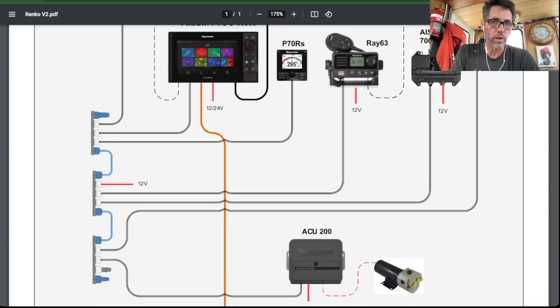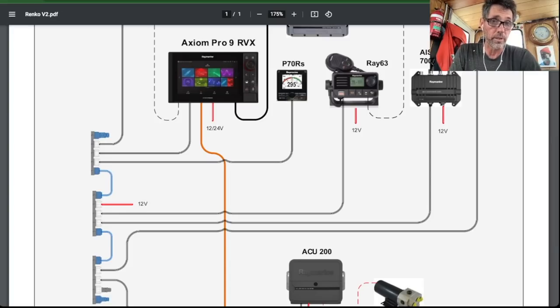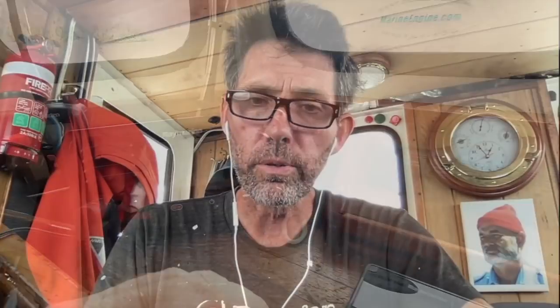You can control the EV1 with multiple dedicated displays in different parts of the boat. The best home analogy is networked printers: you used to plug a printer straight into one computer, then they became network-shared, and eventually the printer connected directly to the network so anyone could print to it. That's the setup we're going for on the boat. Another great example: the VHF radio can send a DSC distress signal with GPS coordinates. Because it's on the network and there are four GPS sources, if anything fails it can fall back to a different GPS source — giving you redundancy as well as flexibility.